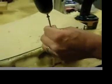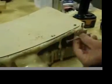You'll notice screws like this one are very long — they're actually not contacting anything until they get to the board below. So don't tighten them up too much or you'll bend the wood. We're using a hand saw to saw the glue that has come out. It gets very hard — it's like a hard urethane foam, which is exactly what it is. Then we take the board out of the mold.